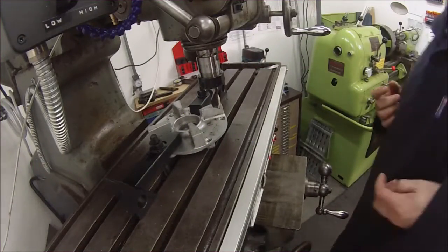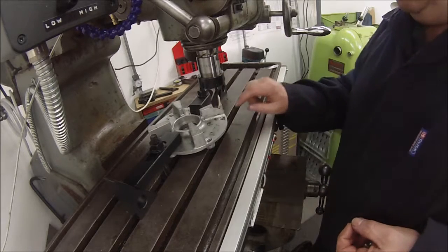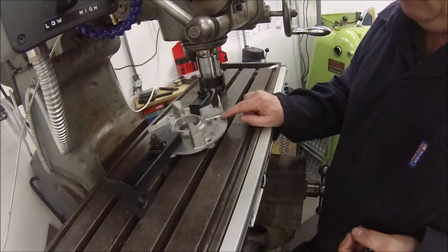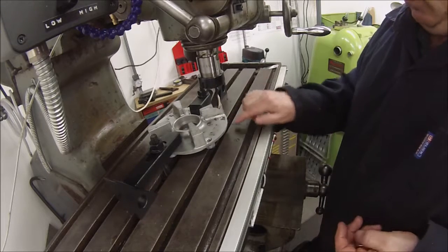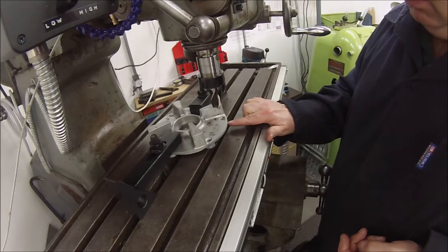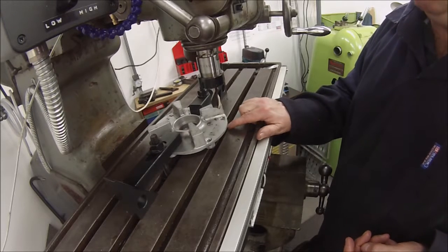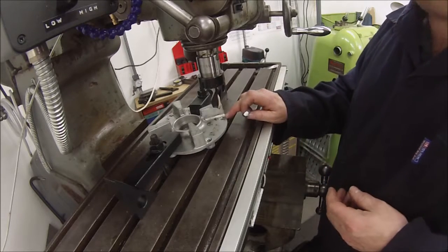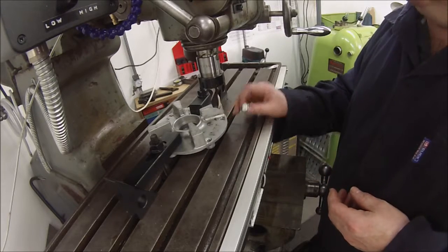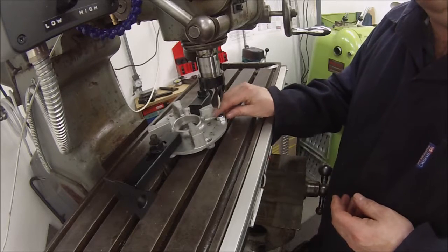I've got the sprocket carrier set back up on the milling table. I'm just going to mill out some clearance around these threaded bosses. Because I've had to remove about half the width, well, what have I removed, 17 millimeters from the front of them, although they're still tapped to sort of the diameter of the bolt, I want to put some lock nuts on the inside there just to make sure.